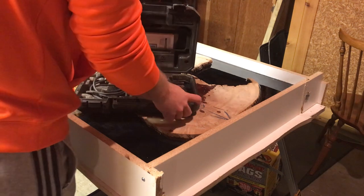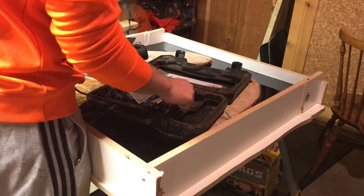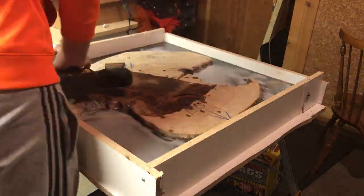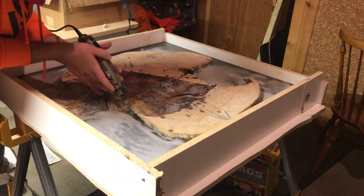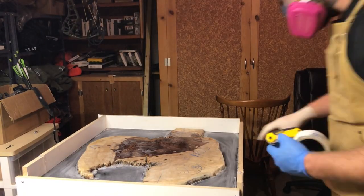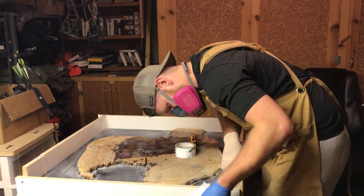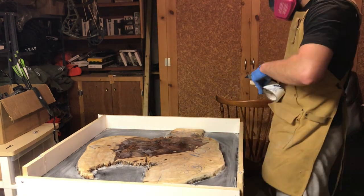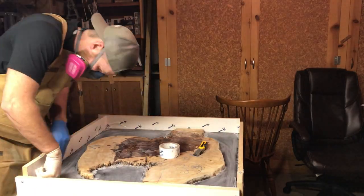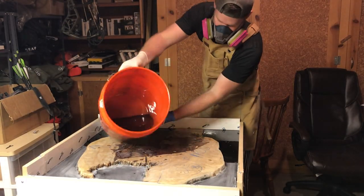This is about two weeks later. I wanted to top this slab off a little more. I thought about just calling it good and letting the industrial sander shave it down that half inch, which would still leave it about two inches thick, but I wanted it thicker. So I roughed up all the edges — kind of a pain with all the little spots — using Dremel bits, a sander, anything in my kit. Then I realized the mold release had probably worn off, so I used Tyvek tape on the edges instead of mold release, since mold release could compromise the epoxy bond on those roughed-up spots.